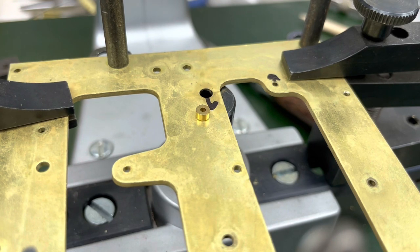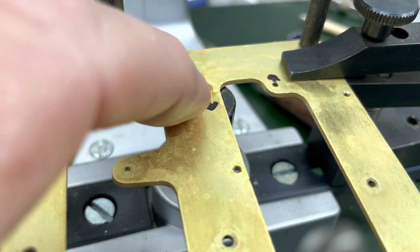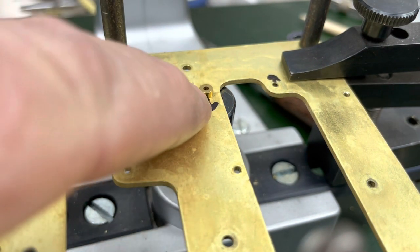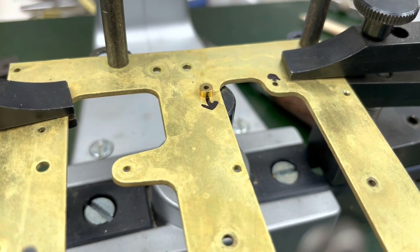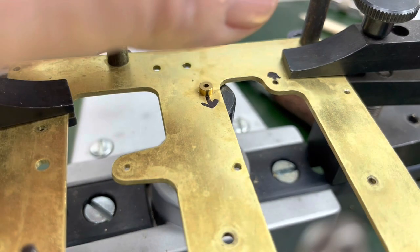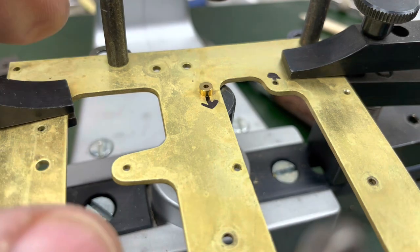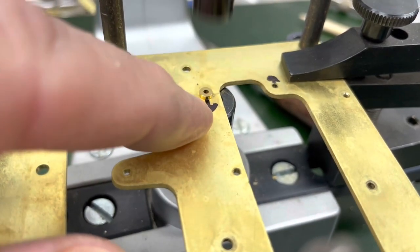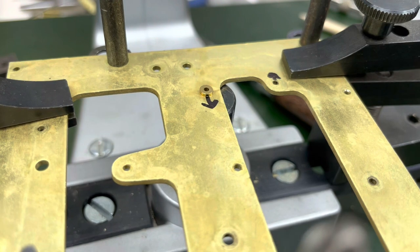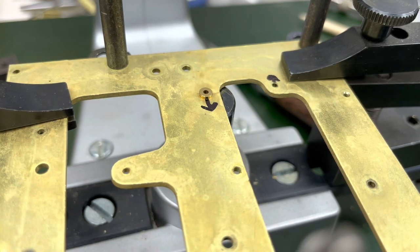I hope that gives you a little bit better look at the process of cutting. Now, I am going to put this in here, even though I don't have the anvil underneath. This is a 2 millimeter depth, high bushing. Normally I pound it in on my solid anvil. I can't go all the way on this. I will finish putting it in after I do this bushing, and then I'll finish both of them with the anvil. All right, I hope you got that really close up.